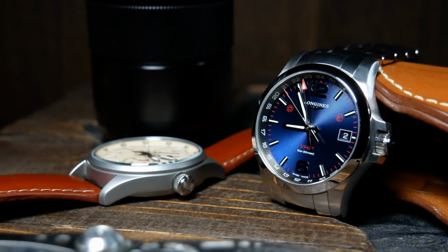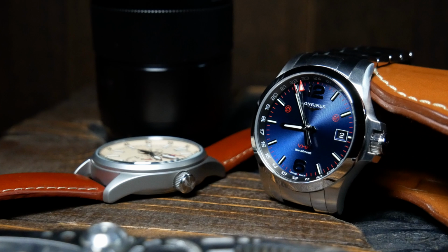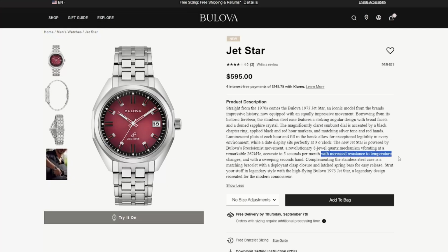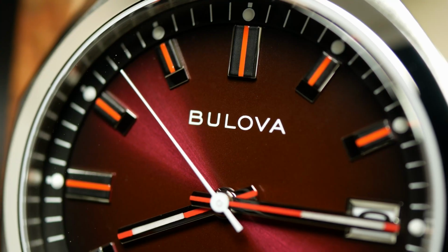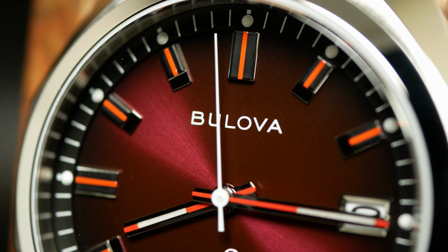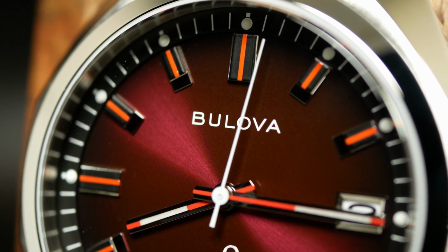Now, that's what we do know. The one thing that's in question here is whether or not Bulova is using any form of thermoregulation, which is a big word, but it's also typical with other high accuracy movements, as by keeping the crystal temperature stable, you avoid fluctuations in accuracy over time. Now, Bulova seems to suggest that they are using some form of it, or at least with this one, because in the description it does mention a quote increased resistance to temperature changes. Yet I've also seen others online who are far more knowledgeable about movements than I am question whether they are, or if they have in the past. So there are some questions here, and I don't have any answers for it. But I'd love to see Bulova or Citizen just go into detail about what they're doing here, especially after a decade.